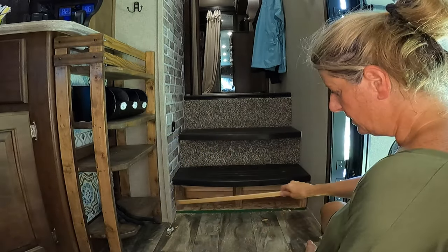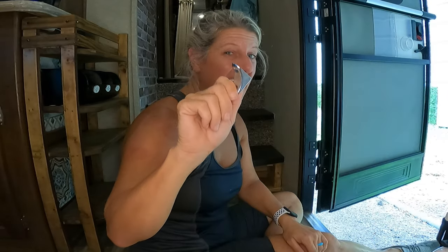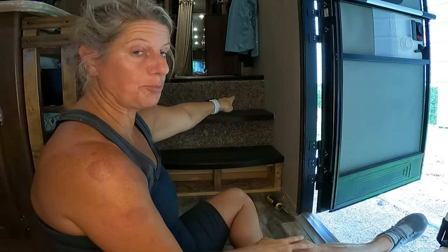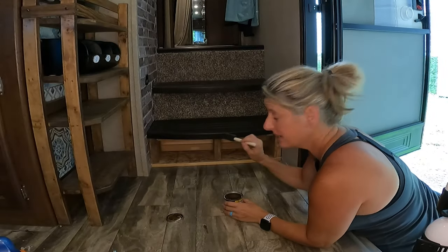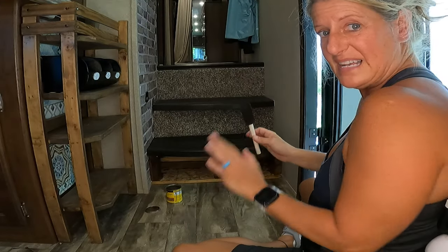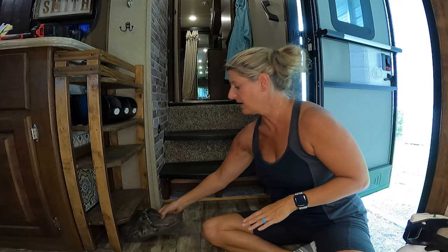I have this little piece of wood to put on the front edge of this piece of plywood to finish it off. I ended up going and getting some chair brackets — I just like how they are better than an L bracket. I added a few of these to the step to make sure it is secure. It felt secure with just two, but I wanted two more. I was going to stain and leave the wafer board on the bottom, but on the next episode I'm changing out these risers and putting in some tile, so I think I'm going to add tile to the bottom there. I've got that stained and now I'm going to cut my pieces of tile and put them on the bottom.